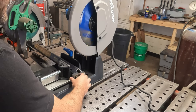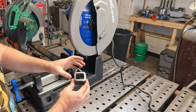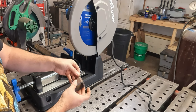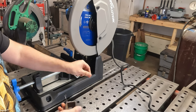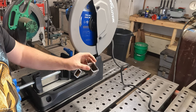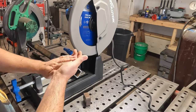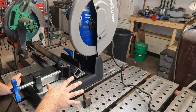That is crazy. No way — look at this. I can touch it, I can hold this. It's cold, cold to the touch. If you've ever used an abrasive saw — I got a tiny little burr right there at the very end where it just ripped off, but this is incredible. It was like 15 seconds to cut through two-inch by two-inch quarter-inch thick wall tubing. Mind is absolutely blown. I'm a believer. This is incredible — that is huge. I'm not even going to do a formal comparison because let's be honest, guys — there's no comparison that needs to be done here.